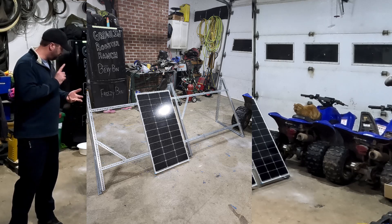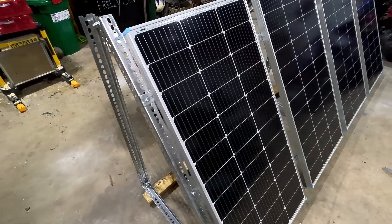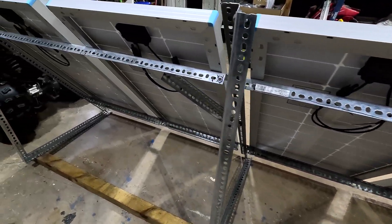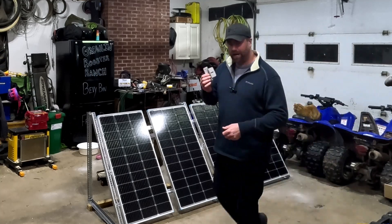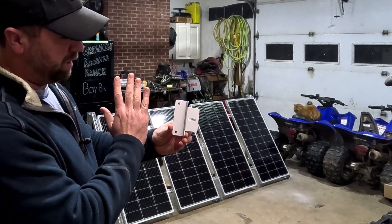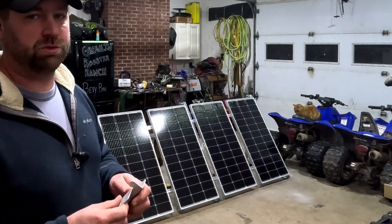It's galvanized and very strong, but you have to bolt it together. So I went through the tedious task of designing the frame. It's not as simple as it looks, even though it is actually very simple looking. I had to make sure that the holes in the angle iron lined up with the solar panel holes in the array, so I'm not stuck using an extra set of brackets. The brackets that come with the panels are great spec-wise, but they're meant to mount on a surface where space isn't an issue — using them would have meant four sets of holes to line up instead of two on each side. So this approach is actually more simple, even though there was more math involved.